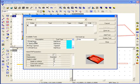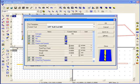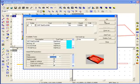So we'll choose a 3/8 ball end mill, and we'll put a depth of 0.9 inches. So we're not going quite all the way to the bottom of the material, and we'll do an overcut here and allow this to travel 0.2 inches past the edge of the part. I'll also decide the overlap and the feed rates here by assigning these values, and we'll keep this an overlap of 50 and assign a feed rate of 300 inches per minute. Now I can hit the OK button, and we'll see that this toolpath is going to be created.